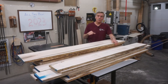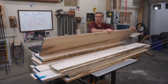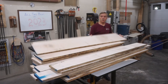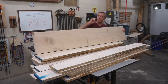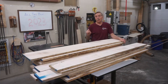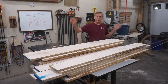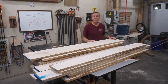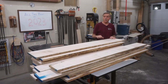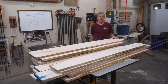That is pretty much what the initial selection and rough sizing process looks like for every millwork project I do. This job is a little less demanding because this stuff will get painted in the end, so I'm really not worried so much about grain match issues. A piece like this will yield two five and a quarter or five and a half inch blanks plus a rip, so the scrap that comes off this will be limited to that five foot three inch length. I don't have any need for full length offcuts on this job — I'll use some of the offcuts for this project, but they don't need to be any longer than the five foot three inch rough length.